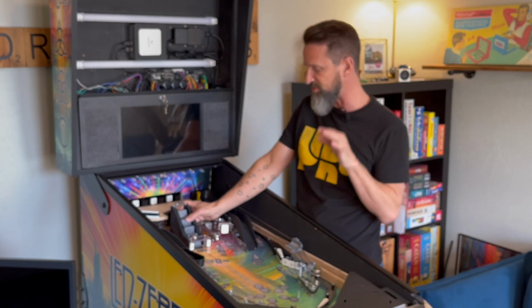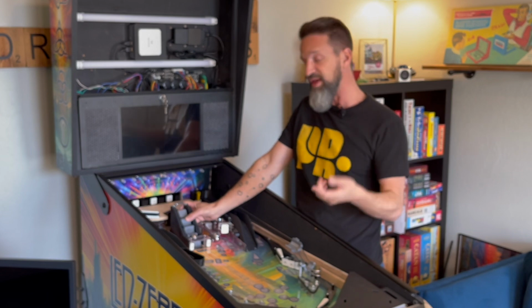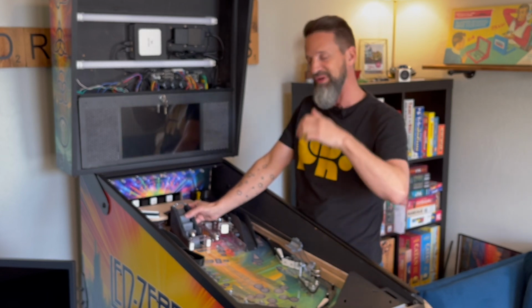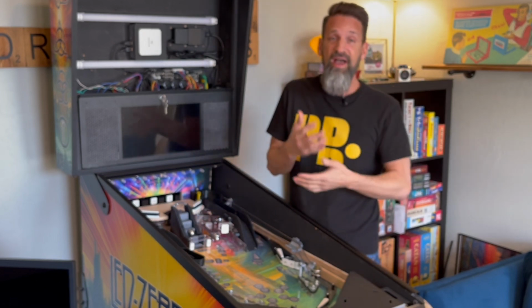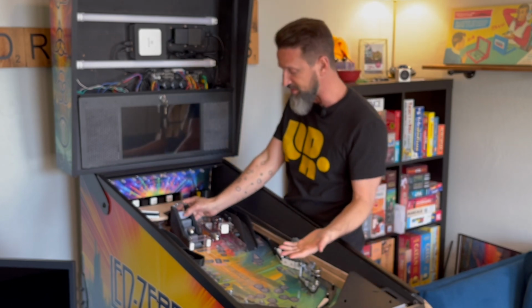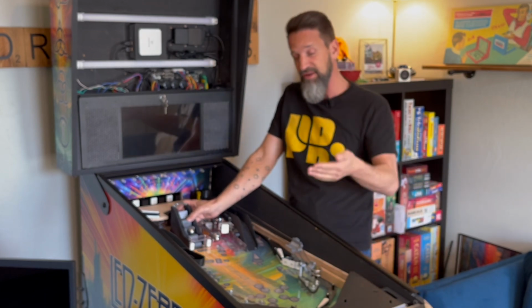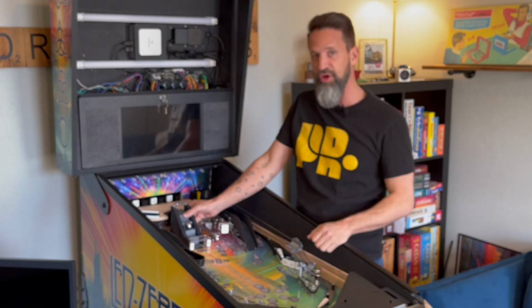It moves about 30 steps, gets it off of that switch, and then it immediately says, oh, by the way, go ahead and now home. So then it moves the last 20 steps. Well, it's a relative amount. It'll move the last however many steps it needs until it's back right where it should be in its home position. So if it's been hit forward 10 steps, I'm going to move 35 steps. It's only got 5 steps left to go. It'll only move 5 steps. And so every time it'll stop when it gets homed.